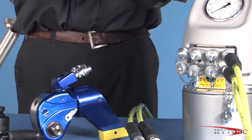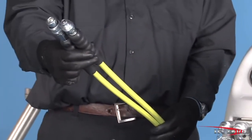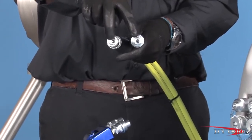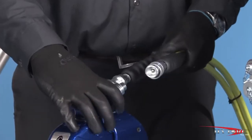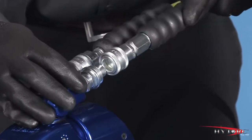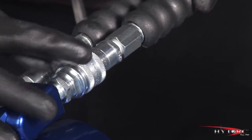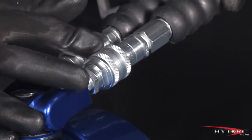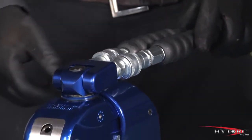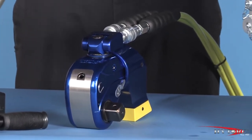The MXT3 is powered by hydraulic oil from a pressure-regulated pump system connected to the tool by special high-test hoses. Note that both the male and female unions feature a small, spring-loaded check ball which must be fully seated for the oil to pass. Ensure that the hydraulic hoses are firmly screwed to the uniswivel using only finger-tight force. Even the slightest loosening of the threaded connector will shut off the flow of oil, preventing a high-pressure leak that could otherwise be dangerous to the operator. Do not defeat this important safety feature by substituting other connectors that may not be rated for these 10,000 PSI pressures.